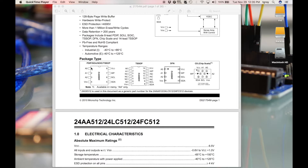I'm going to have four chips. The first chip will have all address pins set to zero. The second chip has pin 1 set high. The third chip has pin 2 set high. And the fourth chip has pins 1 and 2 both set high.